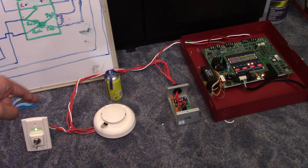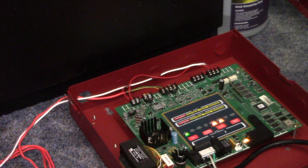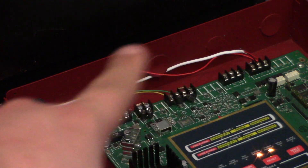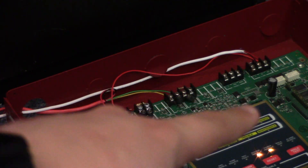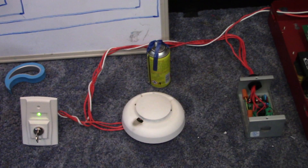It has the red and green LEDs as well as the test and reset function. Let's do a quick overview of the circuitry. In the top right corner we have resettable power — you don't need any other type of power output besides resettable power — the zone, and also we're using our alarm relay. The positive just jumps from the positive of the resettable power over to the common on the relay. The relay is just for our LED lights on the key switch, so it basically switches between the red and the green. We don't need another negative because it's already there from the resettable power, so I can get away with using a two-conductor over there.